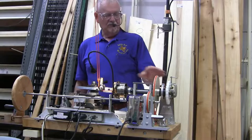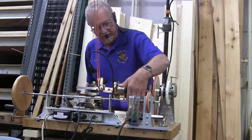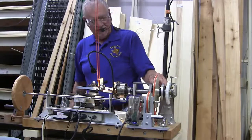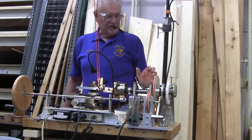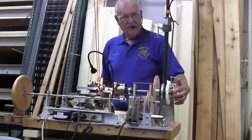Well, the rocking is rose engine. That's what makes it all work, this rocking action. There's a spring over here. Could you see the spring? Okay, when you push it here, it lets it go over, but the spring pushes it back. And that causes the rosette to rub on the rubber, which controls this.